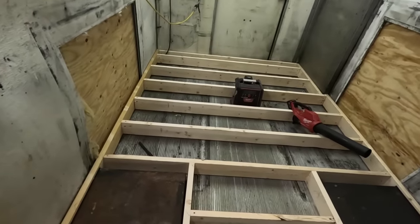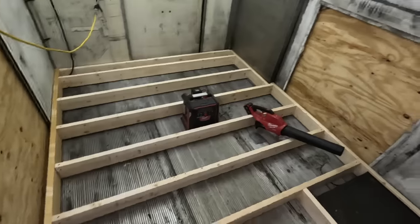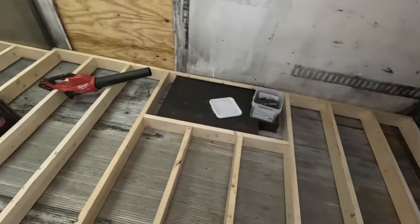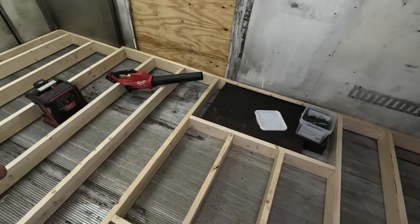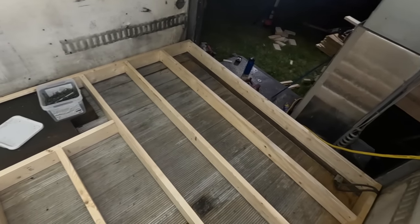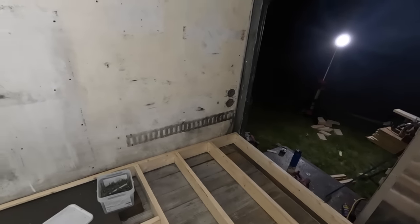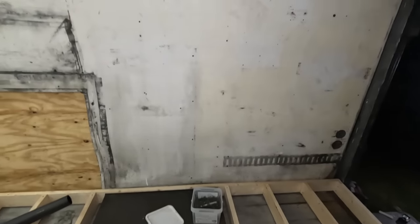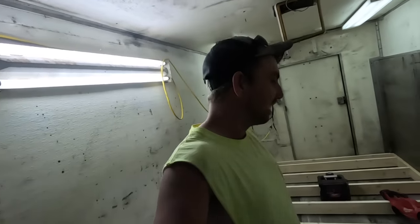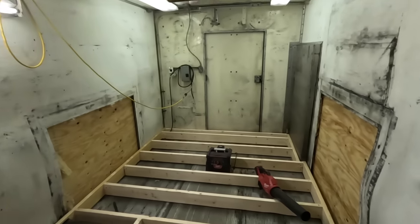Step in here where it's a little brighter — two by six, everything on 16-inch centers. This is all going to get three-quarter plywood on top for the floor. But I've got to get this floor insulated with my spray foam and batt insulation, then I can bring in my big garage box and frame up that back wall. And then hopefully I can bring in all the other material and just frame inside. Already smells better in here — fresh cut lumber is nice.